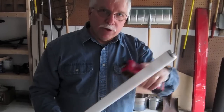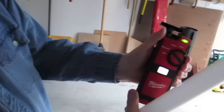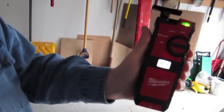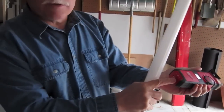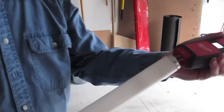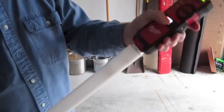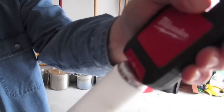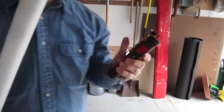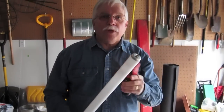Now, if you want to make sure that the filament's okay, you turn the tool to pin. At the bottom of the tool is a spot where you actually plug in the two pins on the end of the bulb — just put it in like that. Hit the test button. Hear that? That tells us that the filament from this end of the bulb is okay. And you actually test both ends of the bulb to see if the filament's good.